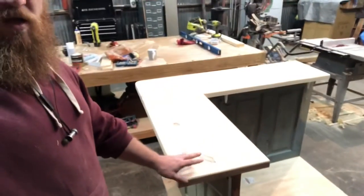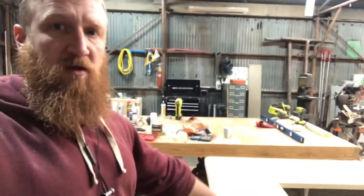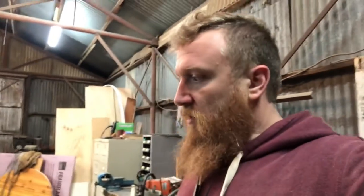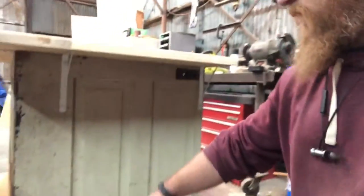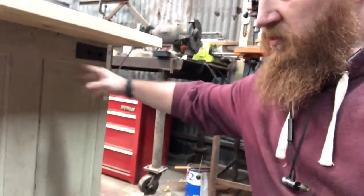The countertop is about four foot that way, three foot on this side — the length of the door. It's two-by material so you're still talking a decent amount of weight, and it's sitting on an inch and three-quarter on the side profile of the door. That's a lot to hang off. So we have these angle brackets all around it, two on each side.